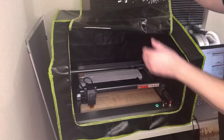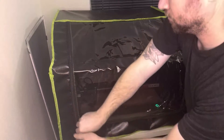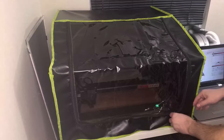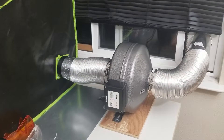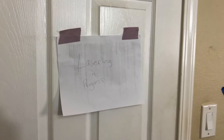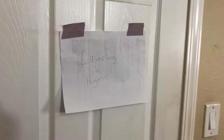I zipped up the vent hood, turned on the fan, slapped on some shades, and pressed play. It's important to not look at the laser without protective eyewear specifically rated for your machine. It's also a good idea to put a sign on the door that warns people not to walk in the room, because there's lasering in progress.